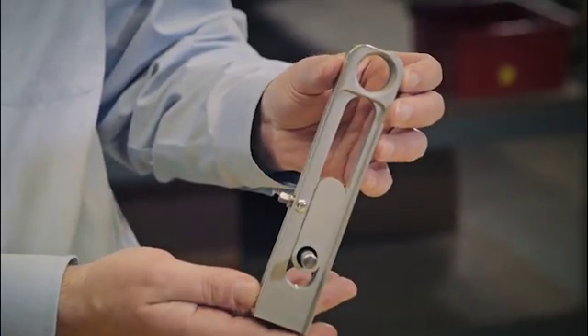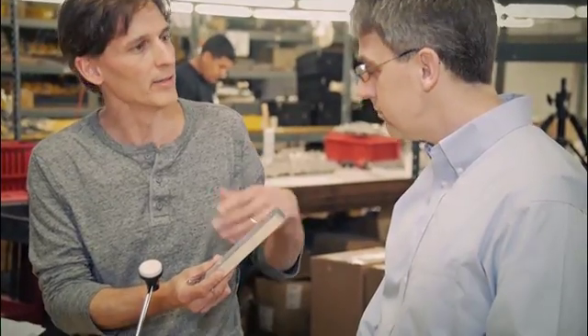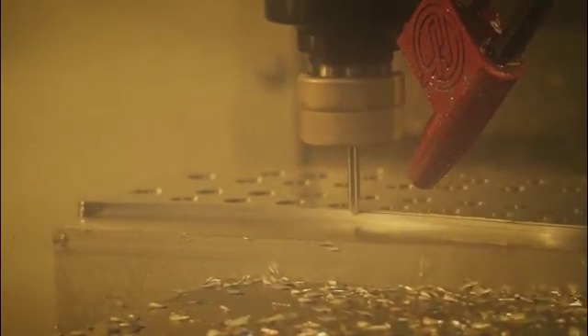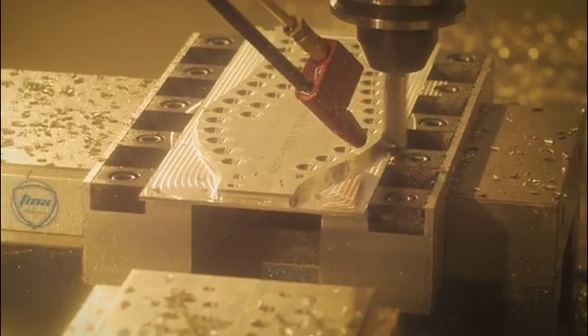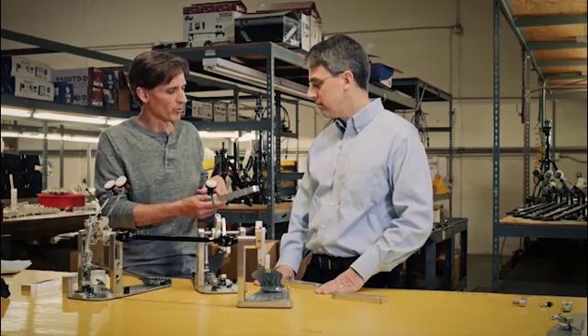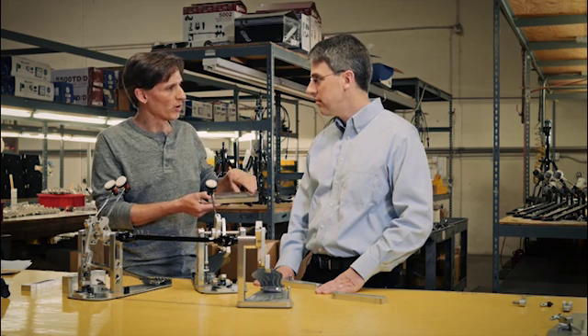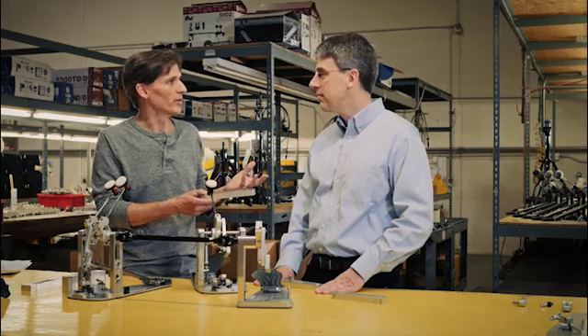You can see one of the final products there in your hand. So we lose the radiuses here — they're already in the shape of the tooling for the extrusion. A good part of the center here is already removed, so we don't have to take that out. It just leaves us a little bit of material just to clean it up. We're able to get it cut. I have to cut billet anyway, so I'm not taking much more time to cut it. I don't have to touch the exterior of the part. We have a hole that's already roughed out there. So we're basically eliminating a good portion of the roughing.